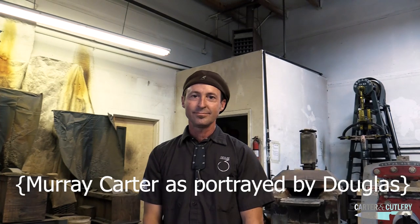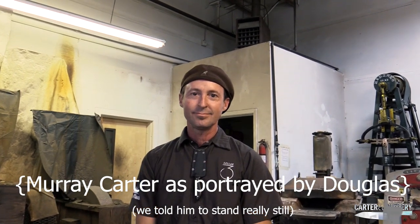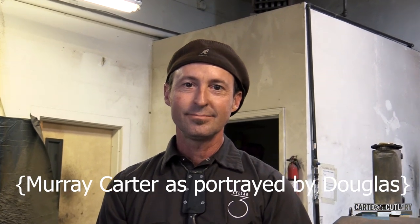I'm Murray Carter. The real takeaway here is: you probably don't have a tagane, a stump, or a brass hammer at home, but what you do have are a pair of eyes. I'm encouraging you to really scrutinize things — straight edges, rulers, the top of your granite countertop, your anvil, and especially your knives. These things we assume are straight and flat — are they really? Use your eyes, scrutinize your blades, and in no time you'll know more about blades than any of your neighbors. Now you know if your blades are straight, and theoretically how to straighten them if needed.